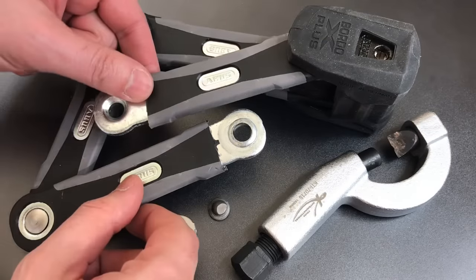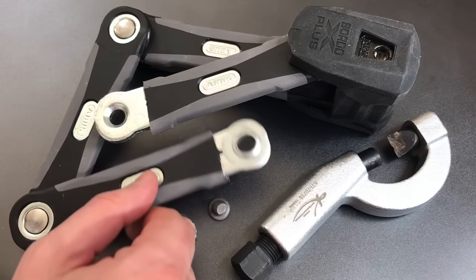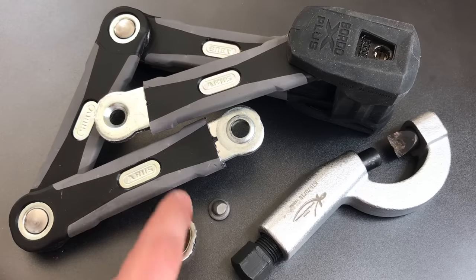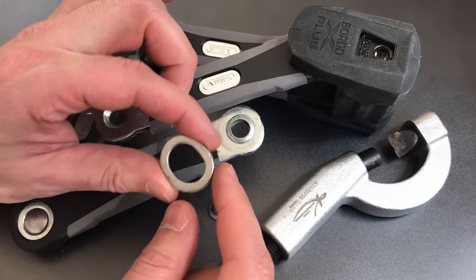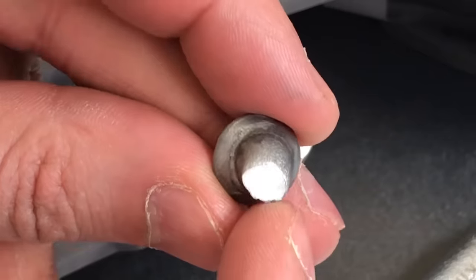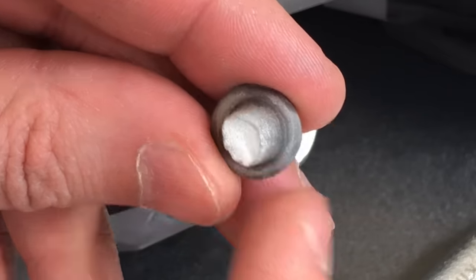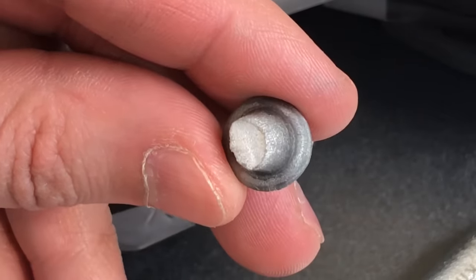As you saw, we were successful in breaking the links apart. However, there was a casualty — the swinging arm of the bike lock unplugged my microphone cable, so we lost the last few minutes of the video. However, I looked around the garage and found some of the parts that went flying. Here we have the hardened ring that protects the rivet — you can see it compressed just a little bit, but did not fail. Then we have half of the rivet, and it's interesting because if you look at it, I don't think the blade of the nut splitter ever touched it. Rather, I think the wedge of the blade simply forced the two metal plates apart, which stretched the rivet until it could stretch no more, at which point it failed.